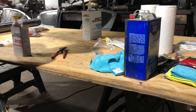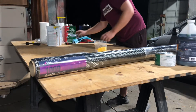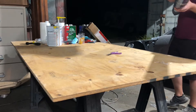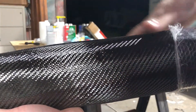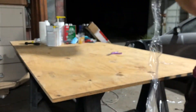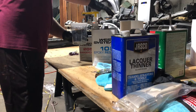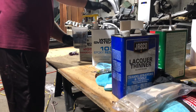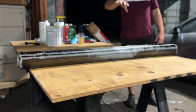After 30 minutes it's still drying, but what I'm going to go ahead and do is cut the carbon. I'm going to bring it up close so you can see the actual weave — it's a beautiful weave. When the PVA dries, I'll make up some resin, get my brush, and brush down the area just so I can have some resin tacking. While that resin is tacking and getting hard, I'm going to go ahead and figure out what size this is.